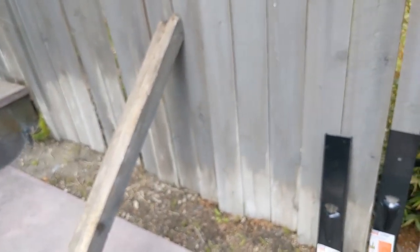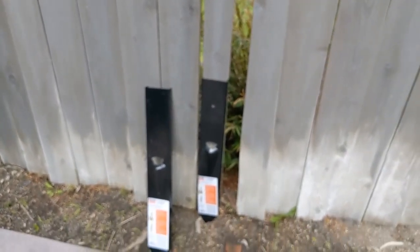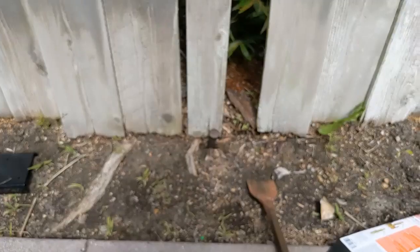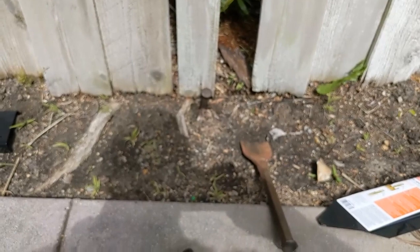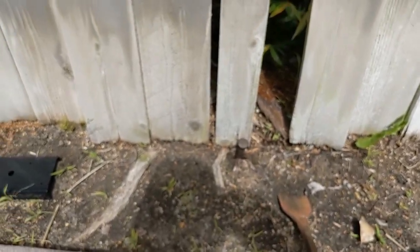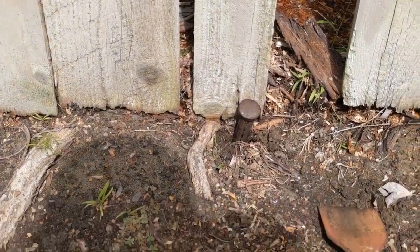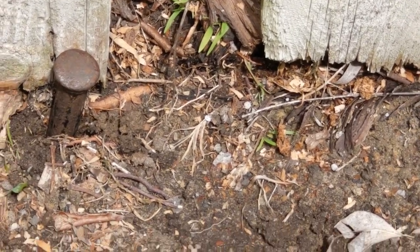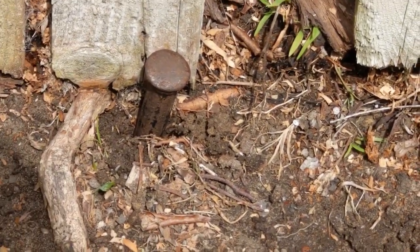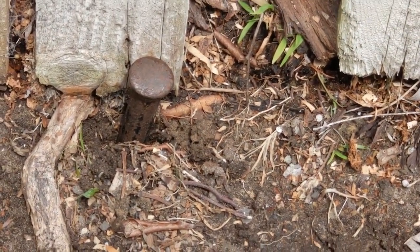This area gets sprinkled. I've torn out all the shrubbery but I'm gonna put some new shrubbery back in. For now we gotta try and save this fence. I've got a little two-and-a-half pound sledge and some cold chisels, and I just drove one in about eight inches. So obviously I'm gonna say there is no concrete base around any of these. If I get rid of that root I might be able to just drive this easy mender in there.